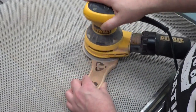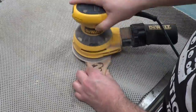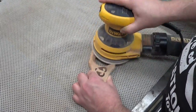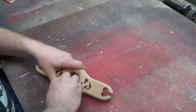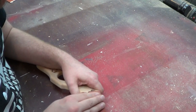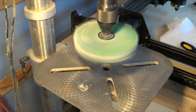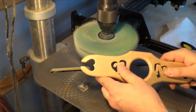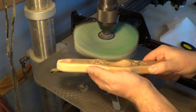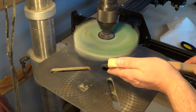Now it's time to do a little bit of sanding — I'm going to sand both the front and the back, smooth out some of the edges, and take this down to about 120 grit. Then a little bit of hand sanding to get to the areas the other machines can't reach, mostly rounding off some of the corners and removing a few burn marks. At the drill press I have a star sander hooked up — a great tool for softening up edges. I have about 220 grit in here and it does a really nice job of smoothing out your projects.